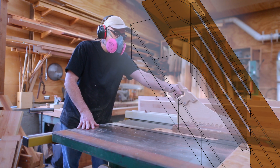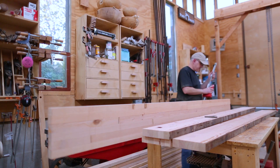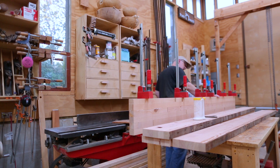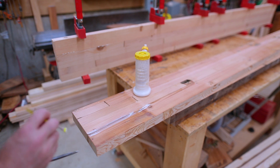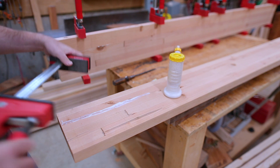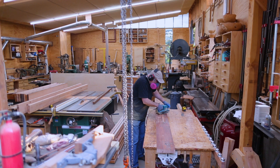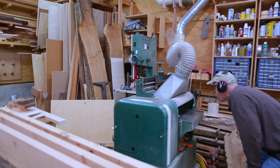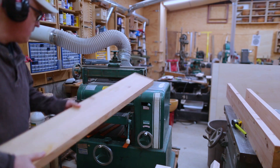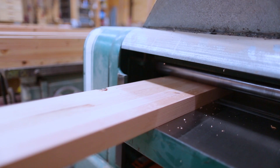The shelf goes from about 10 inches wide down to three inches wide. I had to glue up some scraps to get enough material — but it's a glued-up beam so that's not hard. There were a couple of spots where there were cracks in the wood, so I glued those back together by opening the crack with a screwdriver, getting some glue in there, and clamping it. Then I sanded off the varnish from the beam to clean it up, jointed one face, planed the other, and got all pieces to the same thickness — shooting for an inch and a half, ending up just a hair under.